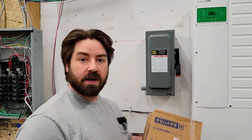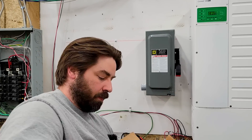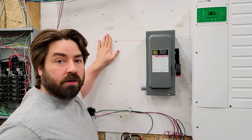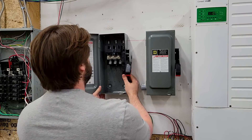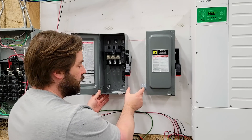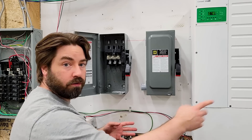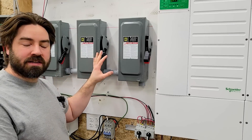I've got one up here already — this is how they come. We pop the box open; they have knockouts on the side and bottom with knife switches inside. I already put in some screws on the wall, so we'll hang it, but it's just temporary. I'll pop out the knockouts and take a measurement for how long a conduit I need to cut and put in between them. I'll run conduit down to the wireway so it can get over to the charge controllers, and some conduit in between the three that I mount.